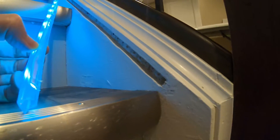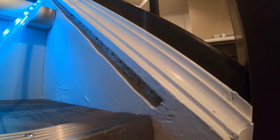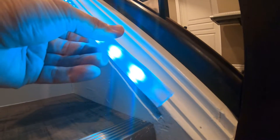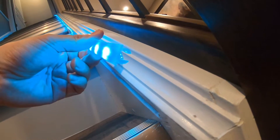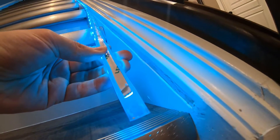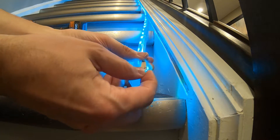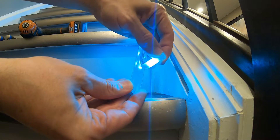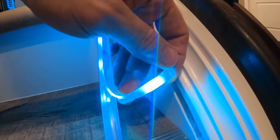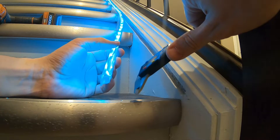I channeled an opening from the bottom of the stairs to the top, which we'll go over in a bit. The plastic track lets the LEDs glow through it, giving off diffuse light which softens the brightness and offers that theater look. The LED strip light is simply placed inside the track, LEDs facing out. Due to the U-shape of the track, the LED strip stays in place without having to secure it in any way — I actually left the adhesive backing covered on the LED strip in case it's needed for future projects.